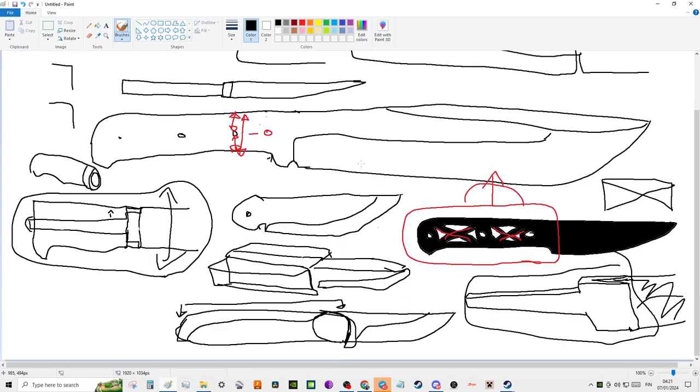And what you see on Japanese tsubas, now let's go down here, a tsuba on a katana, when they cut this middle section, right, they're very clever. What they do to make them strong is they often see where those sharp corners are. They will cut out a section like this on the top and the bottom. They fill that up with brass, right? And then they cut those corners in. So those corners are actually carved into a brass fitting, right, to prevent, because a tsuba is going to get a lot of force. It's going to get impact.